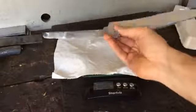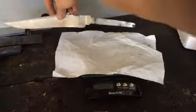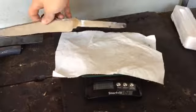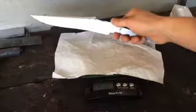So what I'm gonna do now, before I heat treat it quickly, I'm gonna heat up this tang, and I'm gonna bend it just a little bit. It's coming off pretty straight, and I'm not exactly sure what Frank is wanting, so I'm gonna give it just a tad bit of a bend towards the end, because I think he might be doing most handles you want to have something curved, so if it's completely straight the whole way, then it's not as good. So just the back portion, I'm just going to hammer it down just a little bit with the torch,